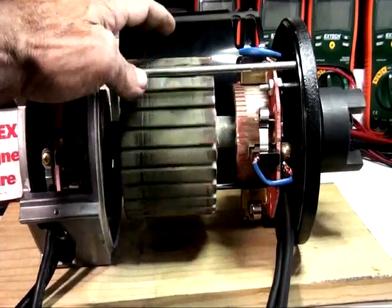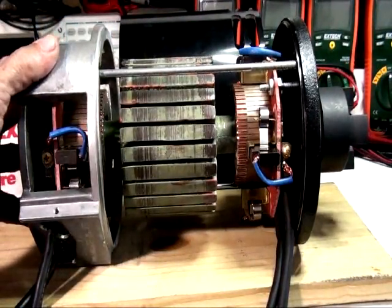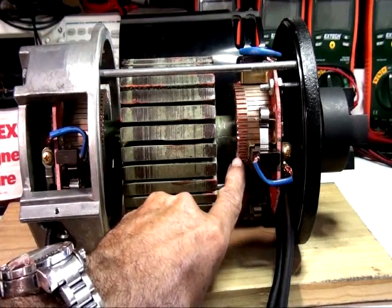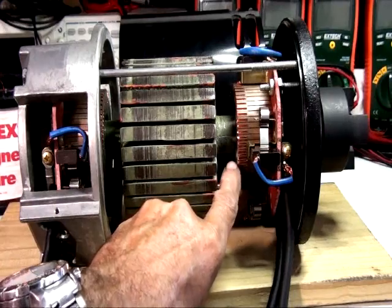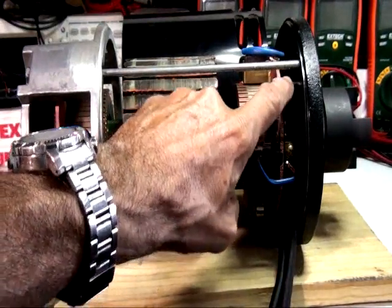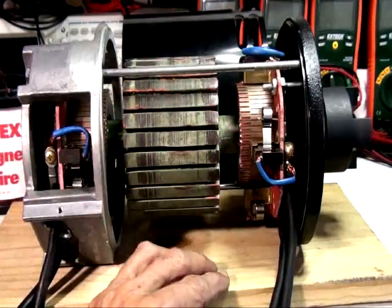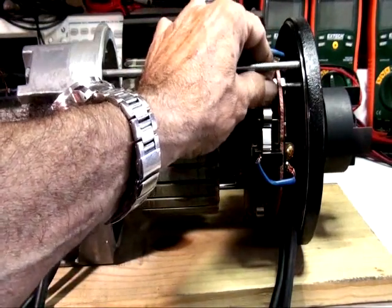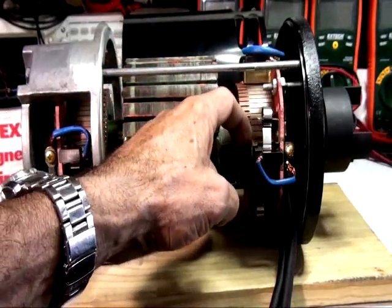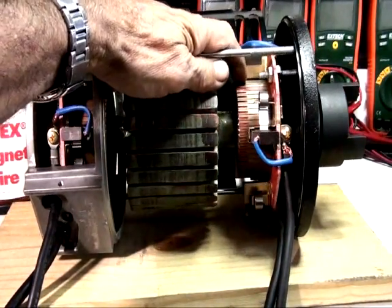Here is the armature — the rotor already fit inside the casing. The good thing about this motor is that it was able to fit in there perfectly without replacing the shaft or elongating the body or the frame. I just have to drill three holes to hold the brush board, thread the holes, and I used 12-24 bolts and nuts. I can adjust them and put some lock nuts and adjust them to the height. I used some spacers to even out the space between the brush and the commutator.